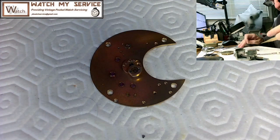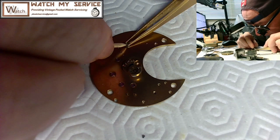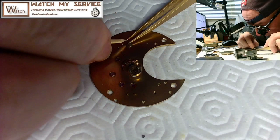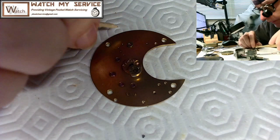I find that just taking a piece of pegwood and scraping the jewel capsule off does a great job of cleaning it. I'm scraping the complete capsule as well in case there's any residual stuff in there. What I do is look at it at an angle to see if there's any dirt left over on that capsule.